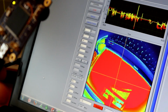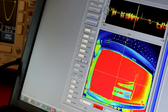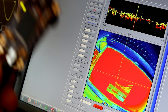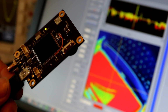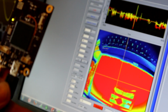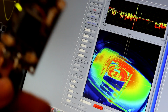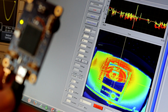And as you can see, this communication link is running at around 12 frames per second. So it's not extremely fast, but it's one of the fastest ways to get data without any problems or going to USB protocols and USB programming that's quite difficult. From the LabVIEW application I can change many parameters, like integration time, gain, system lag, picture in picture, analog offset and so on.